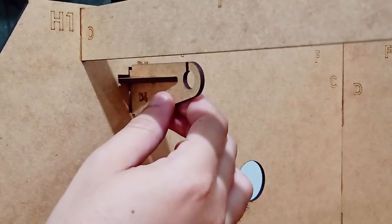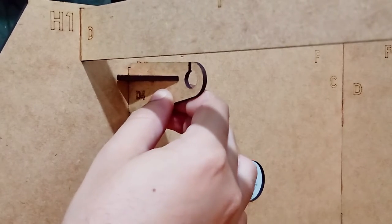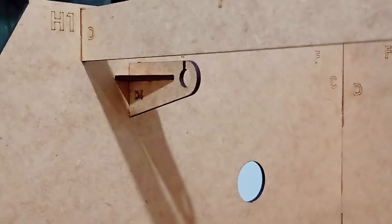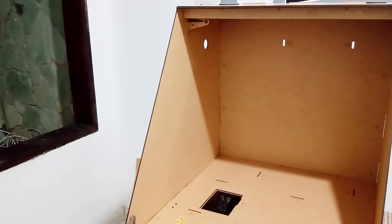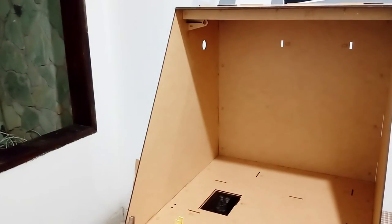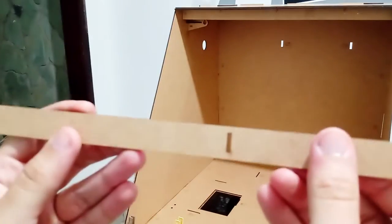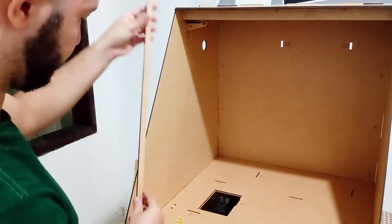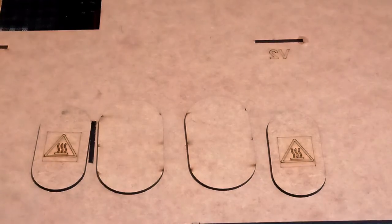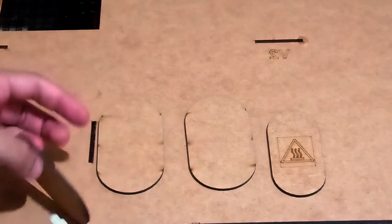I also created a guide made out of Teflon tube and I will use it to guide the filament without any bending. I don't suggest using it without the tube because you know what happens when there is friction for a very long period, right? Oh yeah, I noticed that even though it's well cut, there might still be some kind of opening for the heat to come out. For this I made a guide that closes the door easily and helps to keep the heat inside.